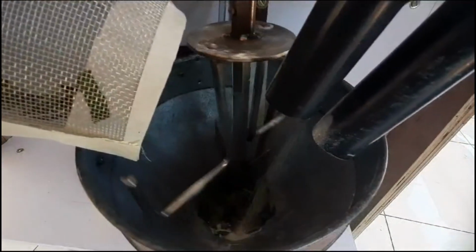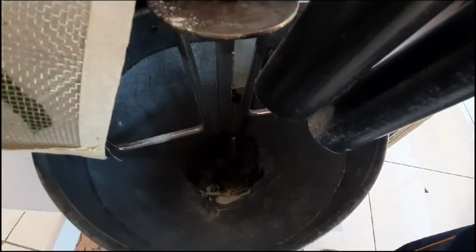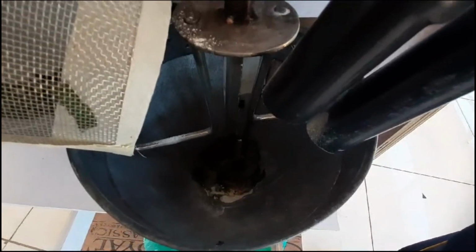Next, the mixer unit. Once the stubbles are chopped, the intelligent system checks humidity levels. If needed, a water sprinkler activates to ensure optimal moisture. Depending on the livestock type selected, the mixer adds jaggery and mineral mixtures for a nutritionally balanced blend.